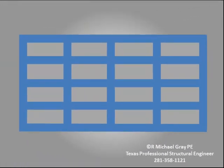In this view, we are looking again at the slab from above. The blue lines represent the stiffening beams. They criss-cross the length and width of the foundation. The stiffening beams are the skeletal structure of the foundation. They are what make the foundation stiff so it can resist the forces imposed on the foundation as the soil below shrinks and swells.